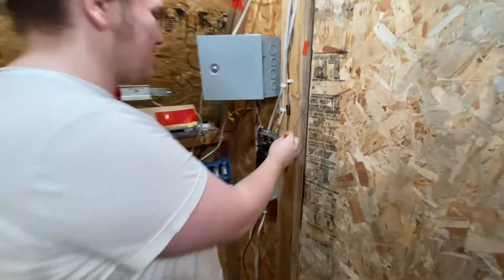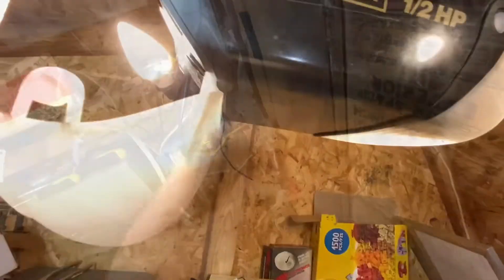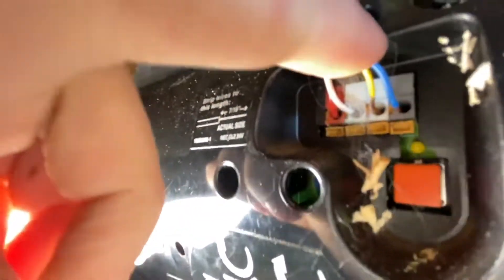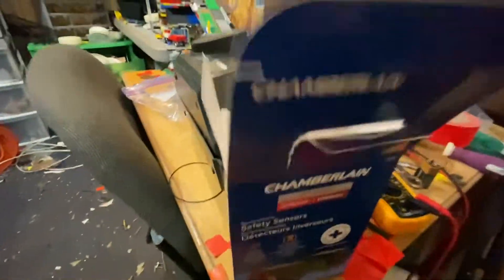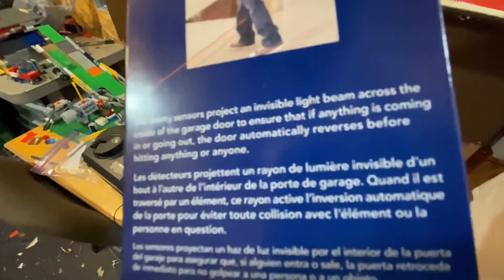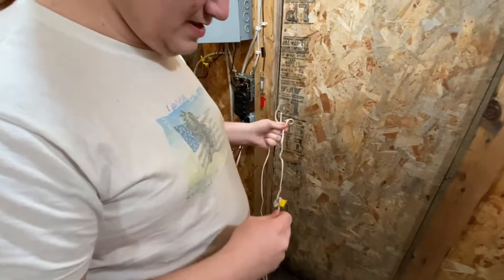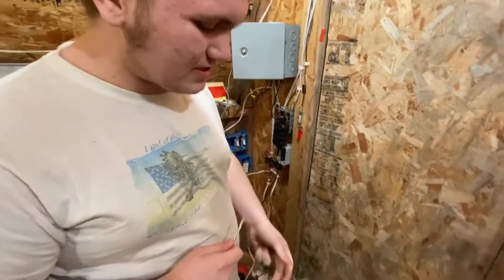Our sensor output is right here. I forget which one is actually positive and which one's negative — looking over here we can see that blue is our positive. We got some cheap store-bought Chamberlain garage door sensors that I picked up for about 30 bucks at our local Lowe's. I could have probably gotten original sensors for this unit, but who cares — it'll work, and I don't feel like having to wait a long time.